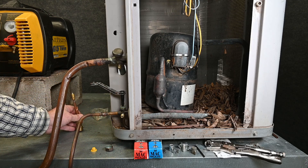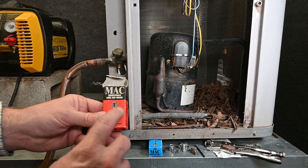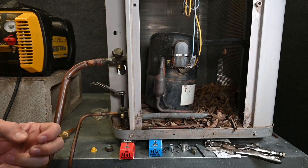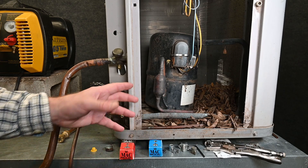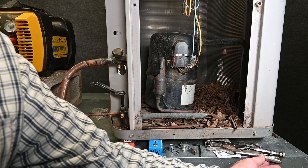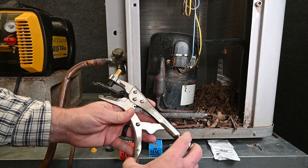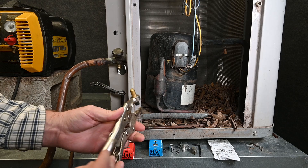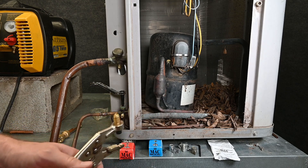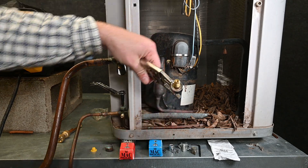In the older days, we had two different options. The first option was called a line tap. What this would do is tap into that copper line, and we could just tap on this side and start pulling the refrigerant. It took a little while because we had all these little pieces to deal with, these little allen wrenches, we had to puncture the line, and it was quite cumbersome. So what I used to do was use this tool right here - a type of locking pliers that would clamp down on that copper pipe. When it punctured the copper pipe, we had our gauge port we could hook up right here. So all I had to do when this equipment was moved out of the way was simply clamp down, lock into it, hook my hose up here, and start recovering refrigerant.